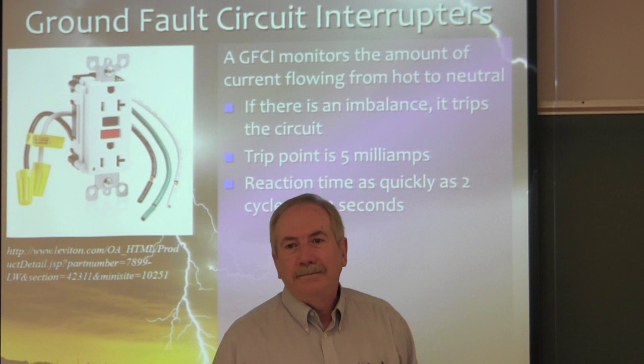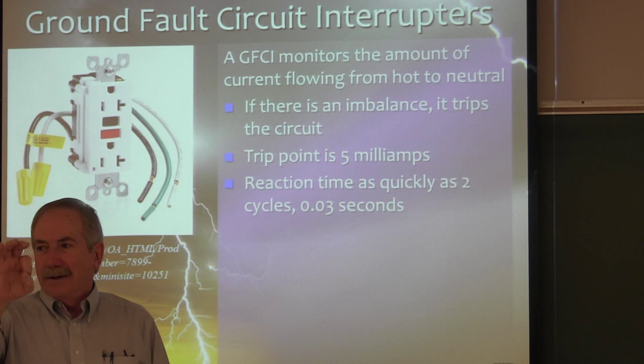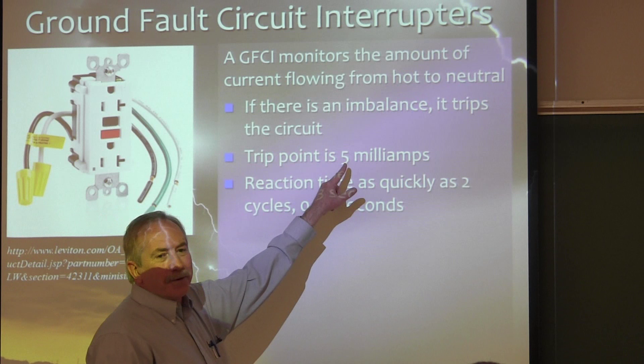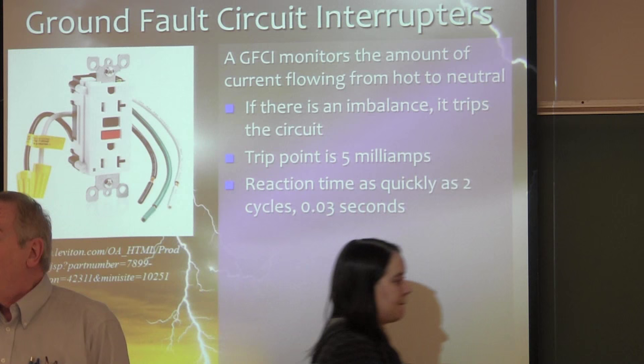This device has a white wire (neutral), a black wire (hot), and a green wire (ground). There is a current sensor inside this device that the white and black wires go through. As long as electricity is going from the black wire into the white wire, that current probe is measuring the magnetic field induced by the current flow. If everything going in on the black is coming out on the white, the net current measurement by that probe is zero. But if current is somehow flowing from the black wire to the green wire, the CT sees an imbalance. Very important: if it sees an imbalance of five milliamps or more, it will trip open very, very fast.